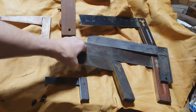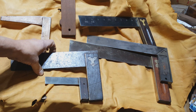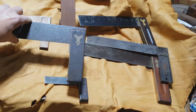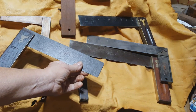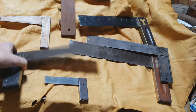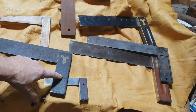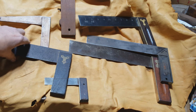The early tri-squares had diamonds for holding the handle to the blades, like I showed in the miter squares. They also had this kind of an astragal plate. This one's obviously in kind of rough shape — I haven't done any work on it. You find these by a lot of makers, including the earliest Stanleys, which some of them had the eagle mark on this side. Those are very collectible. Or the original number one Stanley tri-squares, which had a brass star inlay on this side, and they usually don't have the company mark on them. They show up once in a while, but not very often.